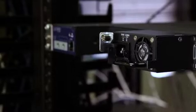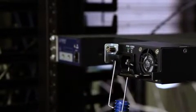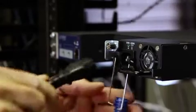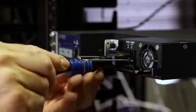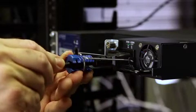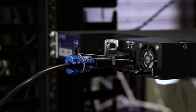Squeeze the two sides of the power cord retainer and insert the L-shaped ends into the brackets. Then insert the coupler end of the power cord into the AC power inlet. Push the cord into the slot in the adjustment nut and turn it clockwise until it's snug against the base of the coupler, and until the slot in the adjustment nut is at least 90 degrees from the top of the power supply.